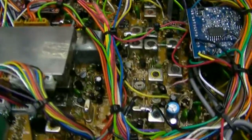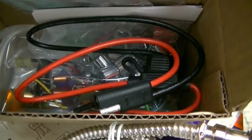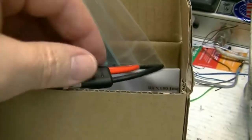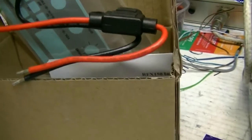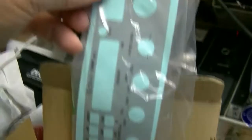One more shot of the inside before I put the cover back on. Yeah, I got the wires all dressed up. Two white wires there go to the speaker. One other thing — all of your old parts and your new power cord are in this box, along with the instruction sheet for the RFX 150 and your TRBX3 is down in there also. Here's your power cord — it ain't very long, so make sure you use the same gauge wire when you extend it to the battery. It says 14 AWG on the side, but I would recommend going to 12 because of the length you're going to need to run to the battery. And there's your old face.